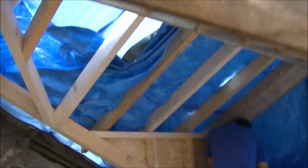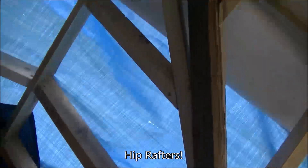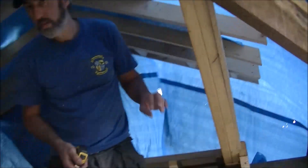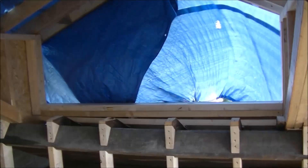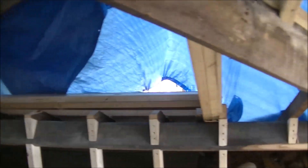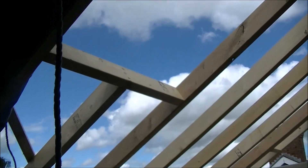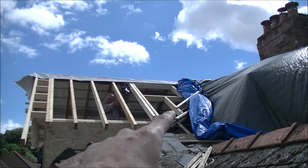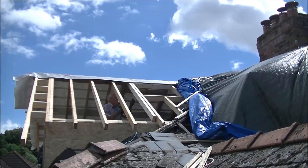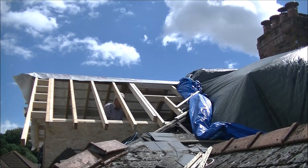This is what Big Pais has been doing. If you look under here, you can see this ridge board has all the rafters on it now. These two diagonals — one there, you can see one just down there. He's just attaching a bit of OSB to the front. We've got this opening there which will have the window — you obviously have to put some verticals on. You can see how bad that wind is at the moment on this tarpaulin. Pais has been doing a Velux opening just by there — that's for the smaller Velux that's going to be on top of the stairs. You can see that Velux opening more clearly now from the outside. We're just doubling up the rafters as we did on the other Velux windows — put those out to the side to give it a bit more strength, and that'll be solid as a rock.